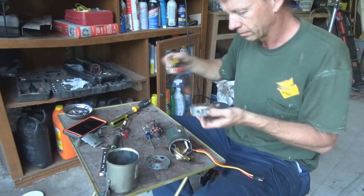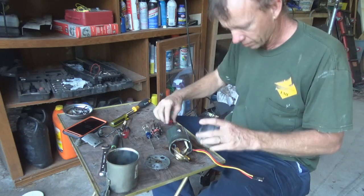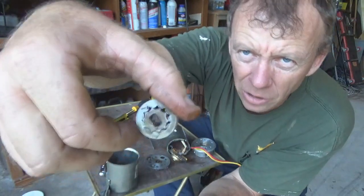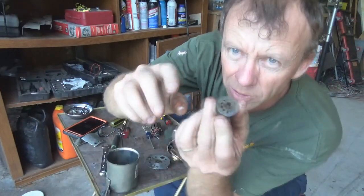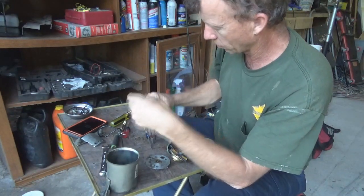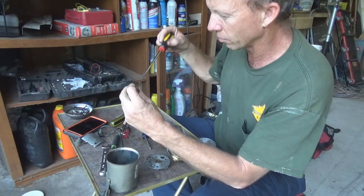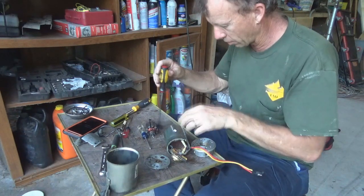That shaft sticks in, and I found these two little gears — I guess they're called the spider gear. See, one's inside the other. Those things were rusted and corroded up — that was the problem. I couldn't get it to spin. The way it was made was like an old Spirograph toy where one has fewer teeth than the other, and it could spin around in there to rotate a little bearing. That gear is jammed — there's a square slot on it that goes on the square slot on this piece, which means yes, these two should turn separately.